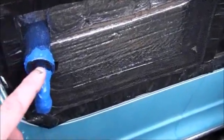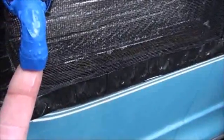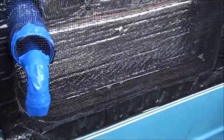I actually tested it. I got it taped up with some blue tape, and I've also got some screening on there to prevent bugs and spiders from building webs. Air comes in here and goes to the bottom of the battery box, pushing the hydrogen gas out the vent. I tested it by blowing hard on the tube and felt air coming out against my face — so it actually does work. The purpose of the copper is that it acts as a heat sink, keeping the air at the same temperature inside and outside the box to maintain airflow. PVC will not allow that to happen.